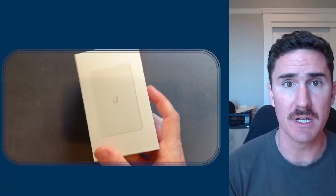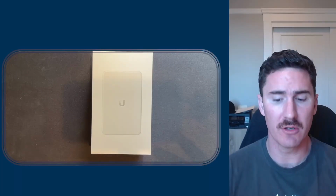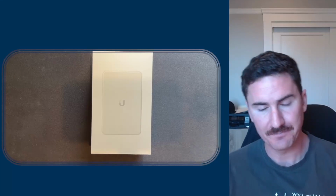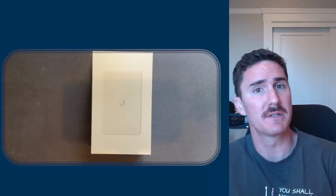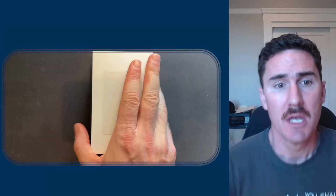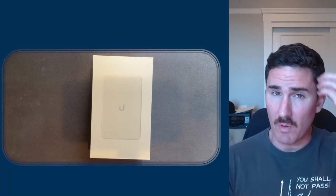And what this is effectively, it's a spectrum analyzer, right? So if you are looking to set up your Wi-Fi configuration, one of the things you'll hear about a lot is what channel are you going to put it on? For 2.4 gigahertz, you've got channels 1 through 11. When you get up to any of the 5 gigahertz Wi-Fi, starting with Wi-Fi 4 (N) and going through Wi-Fi 6, the 5.8 gigahertz spectrum range, there's a lot of different channels that you can choose from, and there's different channel widths, and those all impact how your Wi-Fi performs.